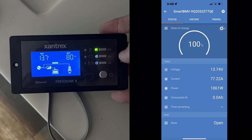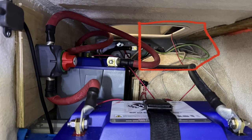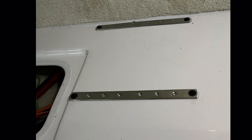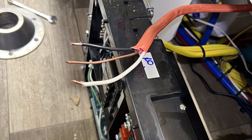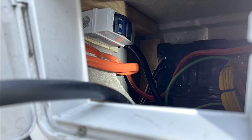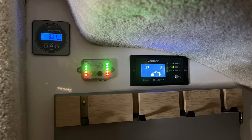You want your inverter really close to your batteries. For me, my batteries are underneath my side bench. I had some empty space near where the tire well is and above the batteries — just dead space I couldn't use for anything. The Xantrex allows an upside-down install, so I was able to install it upside down in the bench right above the batteries. I used some steel braces to keep the fiberglass from cracking while holding up the 16-pound inverter. I removed where the 30 amp shore power plug from the power station unit was connected and connected the inverter output in its place, then installed a new 30 amp circuit breaker behind the power station unit between the shore power plug and the inverter input. I then installed the remote panel above the closet door and moved my battery monitor and propane monitor so I have a single place to monitor all of my systems.